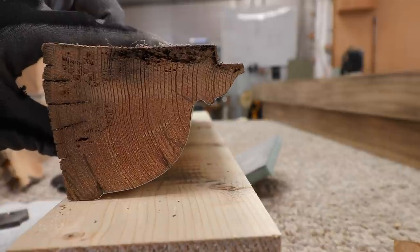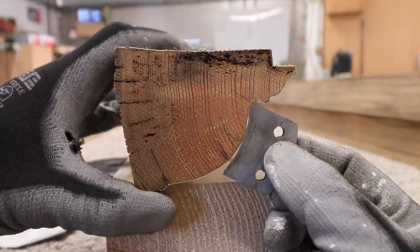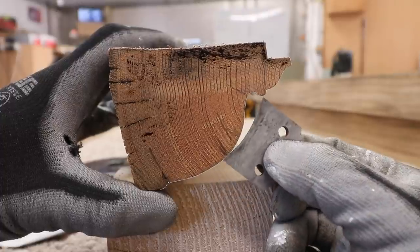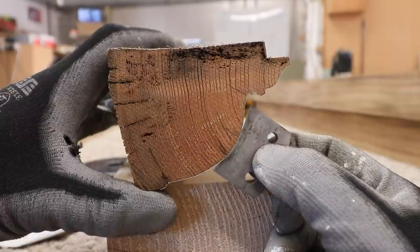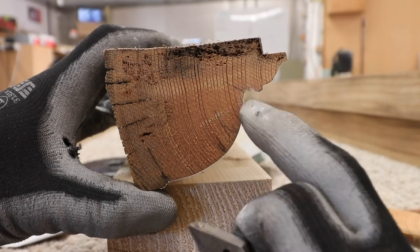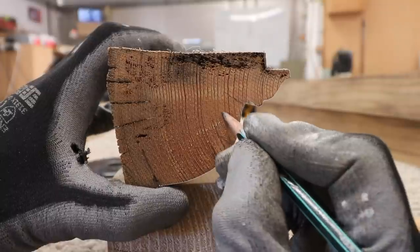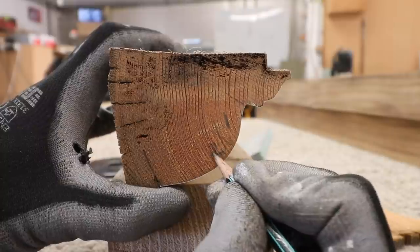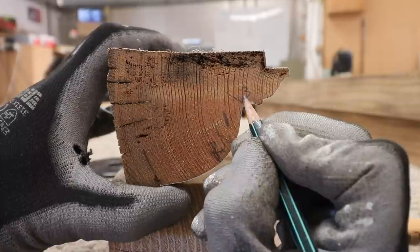Then use my cutter that's ground here, take out this first cut section and do the second cut section, perhaps with it raised up as much as it will go to cut what I need it to. Then do this 8mm bevel up here. So let's mark this out. So that's one. That's number two in the middle there. Then if we do that, there's three there.